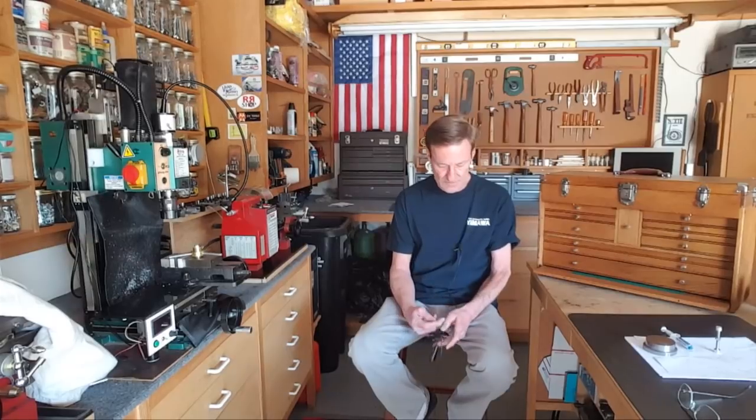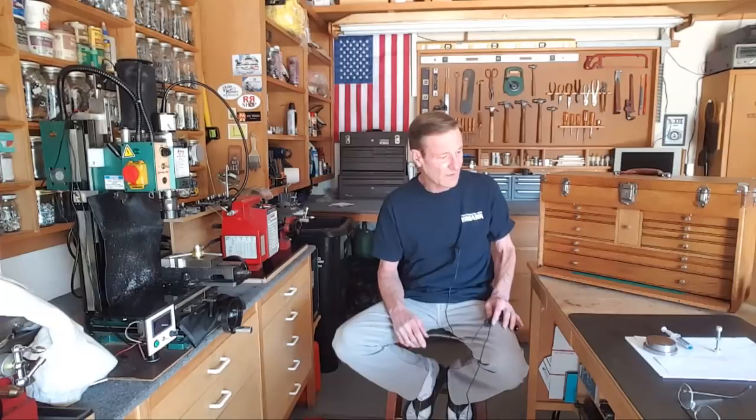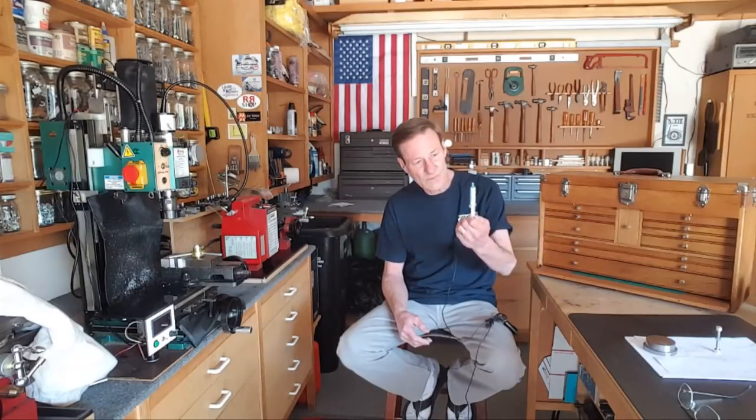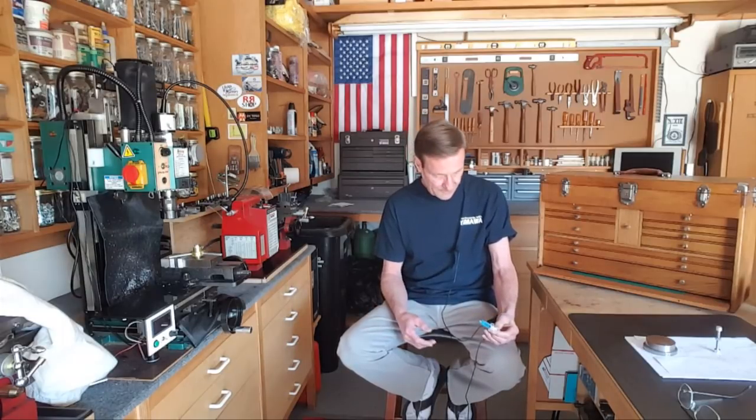Another thing I want to say is I watched one of Oxtool's, Tom Lipton's videos, I think it was 2 or 3 of his ago. Go watch this. He's using aluminum foil to lap stuff with. I thought that was really interesting because I guess the compound sticks in the aluminum foil and so it starts working real fast.